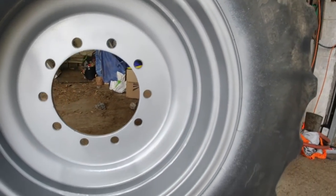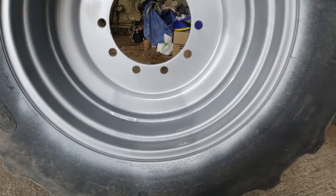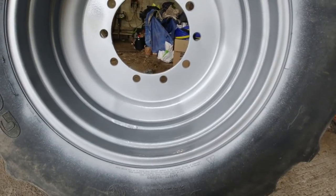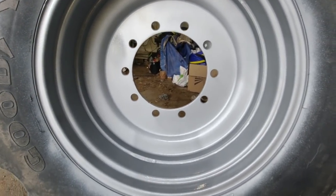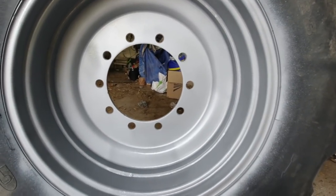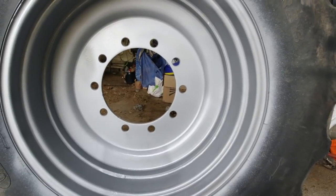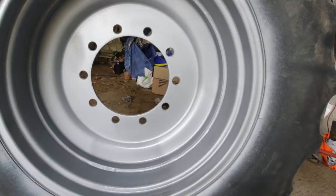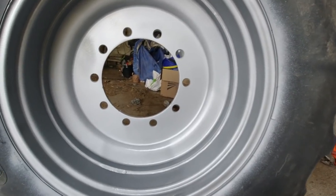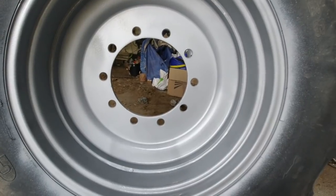Okay, so what we've done is we've gone on relatively light for the first run. That's just basically, if you get that to dry a bit, you have a bit more of a grip on the paint. That's what I find. Look, I'm not a professional spray painter by any means. This is all self-taught stuff, but it's worked for me. So that's what I do really. I go over it lightly first, then the next run a bit heavier, and finally your last run you'll be going very heavy.